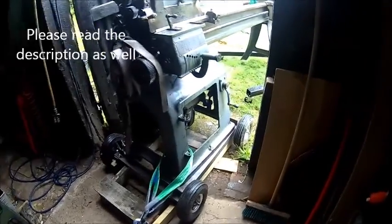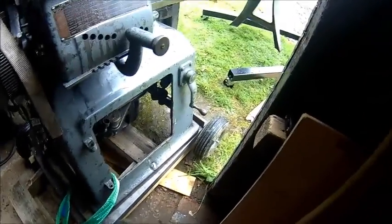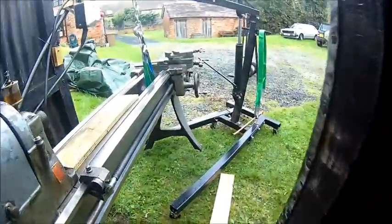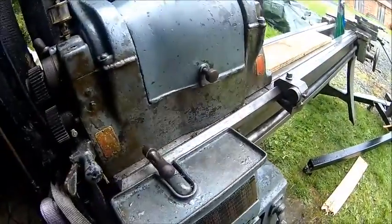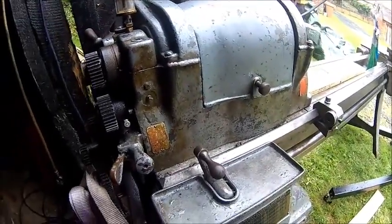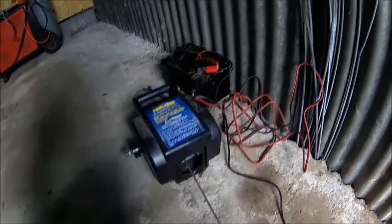We're in the middle of the move. That's how I do it - with some little wheels, and to level it or overcome all the obstacles I adjust the tire pressure. That makes it easy to move, and at the back end we just got the engine crane. The headstock is almost in so I need to reset my rope. I'm gonna use one of these cheapo electric winches here - makes life a lot easier.